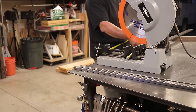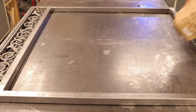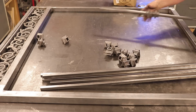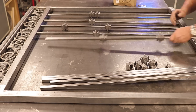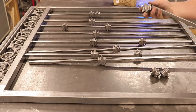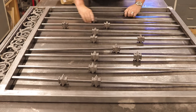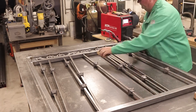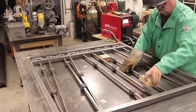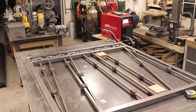These are the pickets right here. I'm only cutting three at a time — three at a time is plenty good. You can see I'm putting the collars on, going two-one, two-one, two-one with the collars, spreading them out a little bit to hold them in place. The way to get started on a gate or fence section is to put the picket dead center and then work your way out on both sides — at least that's the way I do it.